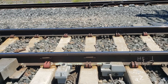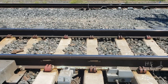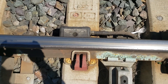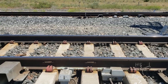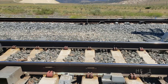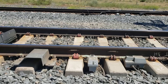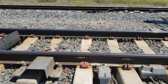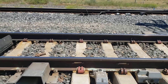If a journal is detected that's too hot, it will broadcast a message over the radio to the train. The train will have to stop. It tells them which axle it is, and the way it knows which axle the problem is is because of these two transducers right here. As the wheels pass over those transducers, it counts an axle. If everything appears to be okay they can continue; if not, they'll set that car out at the closest spur or siding. The hotwheel detector will not broadcast that message and will not stop a train — it will just put the information into the microprocessor unit in the house, and signal operations will pass that on to whoever they need to.